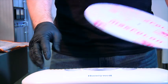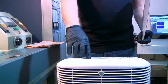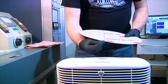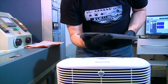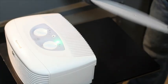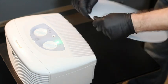In order to combat static, we are going to use an ion generator. There is an ionizer built into this air purifier, and when I run it with the ionizer setting on, it's discharging ionized air through the top. As I'm pulling off the protective layer from the disc, I'll have the ionized air running over it — that will negate the static electric charge. Also, because these are CNC machined, sometimes there's a little bit of flare, so just go over it with your finger to get rid of any loose little bits.